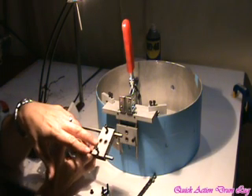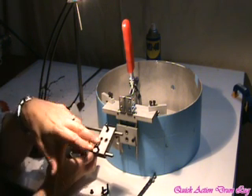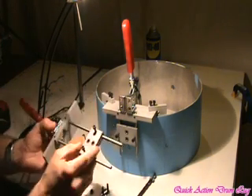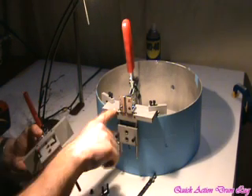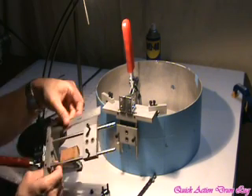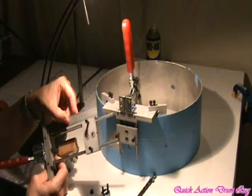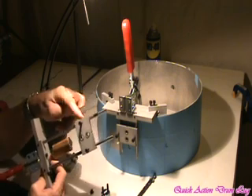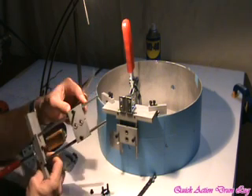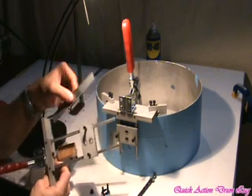The fixture uses drill bushings to give you consistent spacing of the holes, so you don't have to drill oversized holes — you drill precise holes. This plate can slide up and down on these rails based upon what distance you want from the shell edge. You can use your favorite measuring implement and set the distance to the centerline of the lug using the V-notches on the side of the drill bushing plate. Hopefully you can see that, and if not, there are numerous pictures on the site on Ghost Note and on my Quick Action Drum Lug site that show this in more detail.